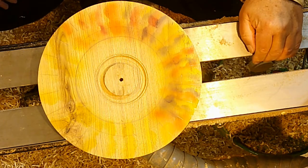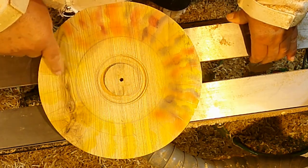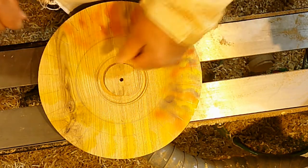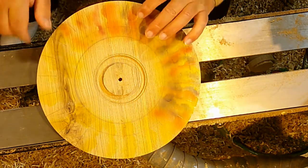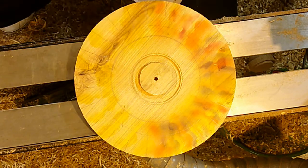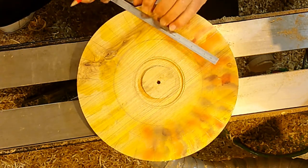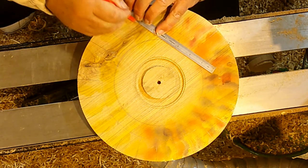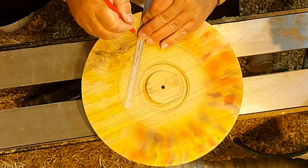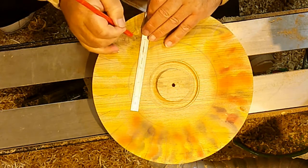So here's the bowl. You can just make out on the left hand side the lines - they don't show up very well under this light. There are 24 lines right the way around the bowl, and there is also a line in there that I've marked - that will be the inside of my bowl. What I want to do now is draw a line from one of those segments where it dissects the rim of the bowl to the bottom of the one adjacent to it, and then the other side. In effect you have drawn a triangle. Then we just work our way around the bowl, marking these triangles. These triangles are what are going to form the basis for our scallops.